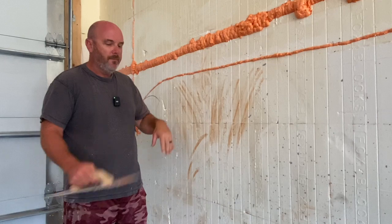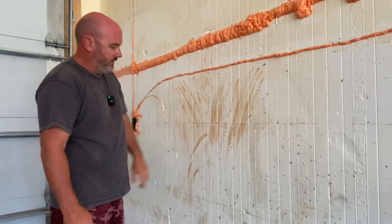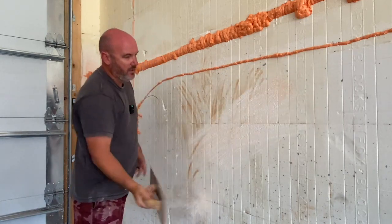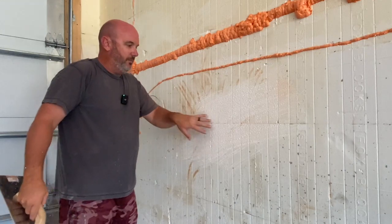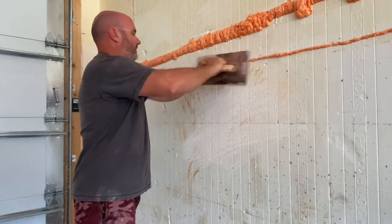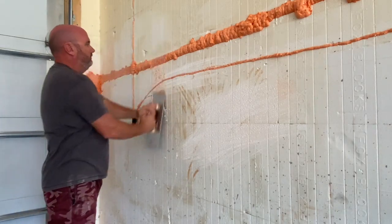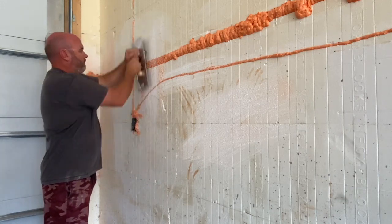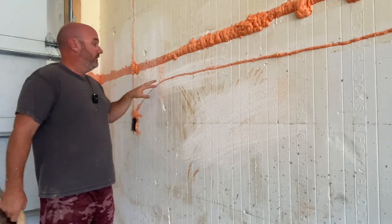You can stick tape to it or anything, but this rasp is just a very heavy carbide sandpaper. You can see all these fingerprints — somebody had muddy hands and decided to wipe their hands on this — but you can make a couple of passes and it's that fast. It just takes off all the degraded surface. That will now accept stucco or something adhesive. Also where we have the electric line buried, it's like one pass and it's flat now, so it's ready for drywall. It doesn't take a lot of work and that surface is now prepped for whatever you're going to do.